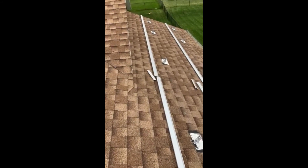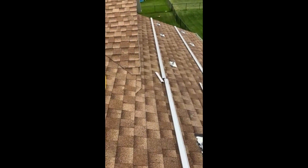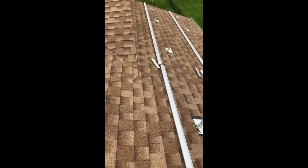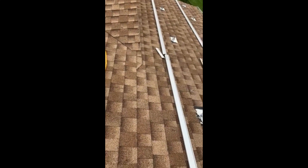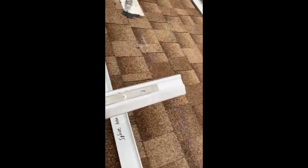Hello YouTube. This video is for attaching two XR100 rails together using a splice. There are actually two kinds of splices — there's an older kind, but this is for the boss kind of splice. This kind does not actually require you to drill screws into it.